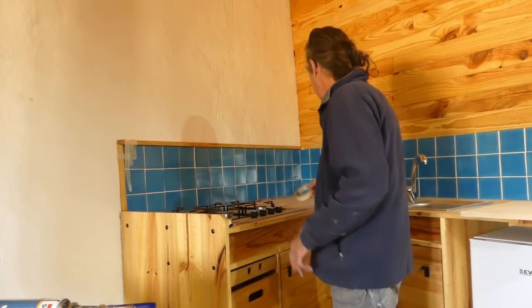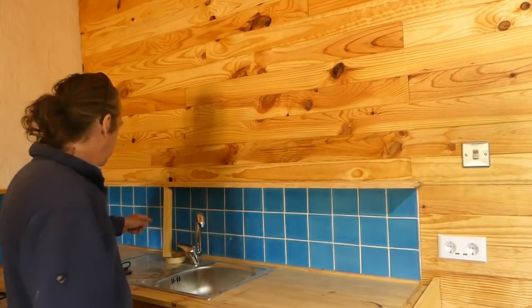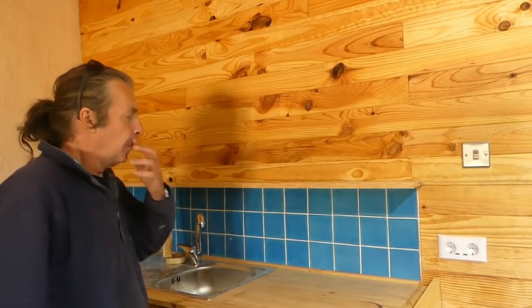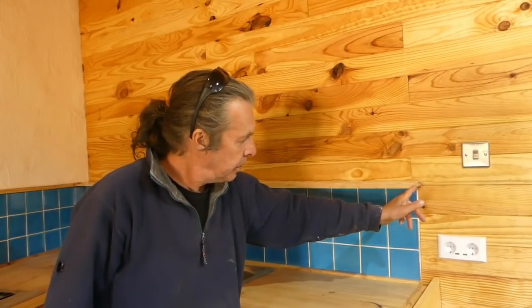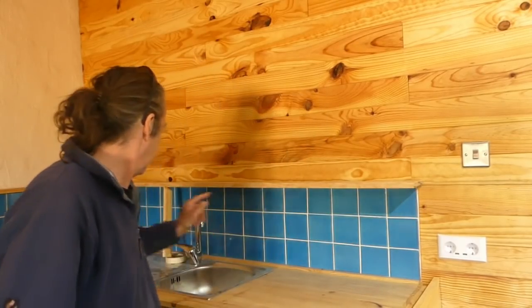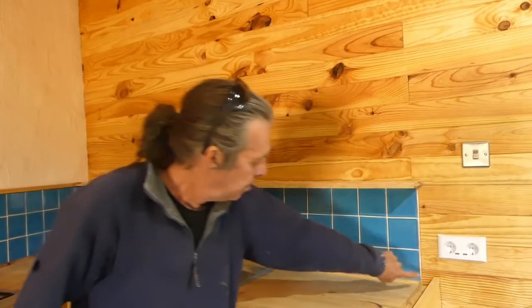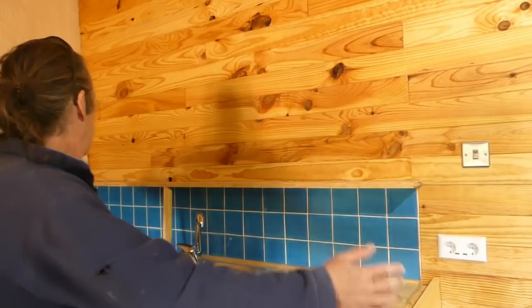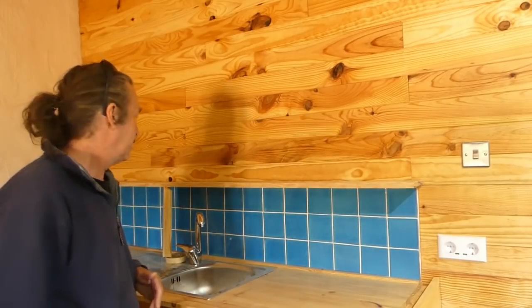Right, so next let's get these shelves sorted out. Right, so the shelves in, I've just got it propped up with my end piece. Super. What I need to do is just trim this end off, take the tongue off it, and then I'm probably going to have to chamfer my edge piece that's going to go in there just to meet up to it, because my shelf's at maximum length, 2 meters, and I can't make it any longer.